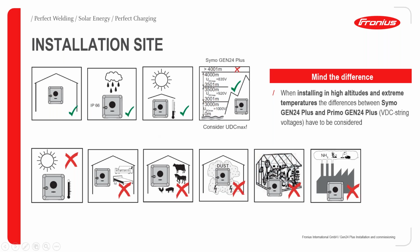In addition, because of the fan noise, it's not advised to install in the living room, or in a farmyard or close to where animals are shedded. This is because cow or animal dung tends to contain toxic materials, usually ammonia, and since they're toxic, it's not good for them to come in contact with the inverter.